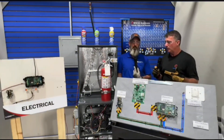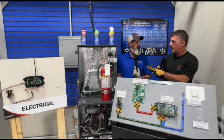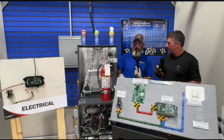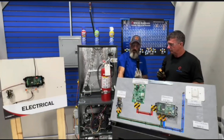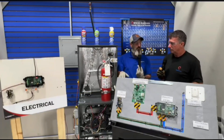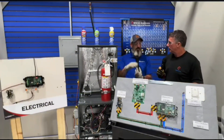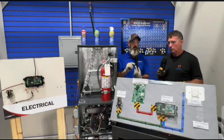We keep talking about this but we've never actually seen what it's going to do. So theoretically, what should happen if our sensor detects a refrigerant leak in the system? Once our refrigerant sensor detects that leak, it's going to power down the gas furnace, power down the outdoor unit, and engage the blower motor for ventilation to dissipate the gases. Once the gas is all dissipated and it no longer detects refrigerant, it's going to stay in that mitigation mode for about five minutes.